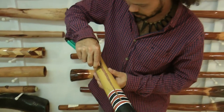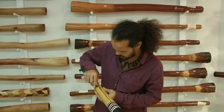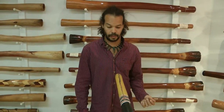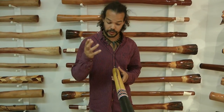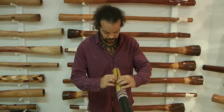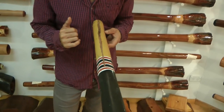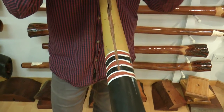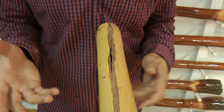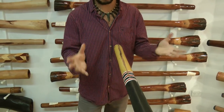We're doing it along one side on this side here, opening it up and getting a nice clear opening slot so we can pack it in later on. Okay, now we've just opened up the crack. As you can see, we've made it quite extensive. We've opened up, and in some parts you can actually see the internals. Doesn't matter. We're going to pack that full of the wood glue and sawdust mix. So there you go, we've cleaned it all up. It's ready to start the repair.